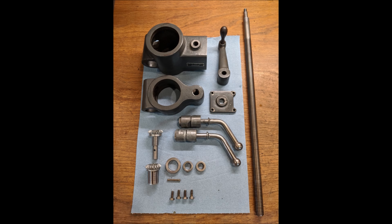So we're on the same page for the next segment with the breakdown: we'll call this the upper collar or gearbox, the lower collar, and the threaded rod. This is a massive three quarter inch threaded rod — Acme thread. And here are the gears. The remainder are the lock handles, the handle, and there are two locking collars on this, and a thrust bearing. Let's break it down.